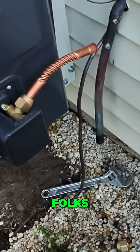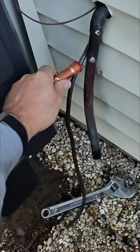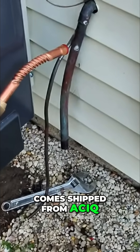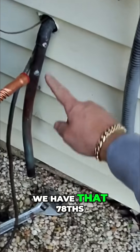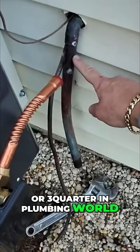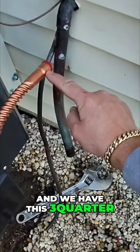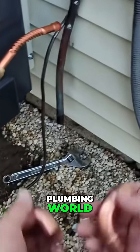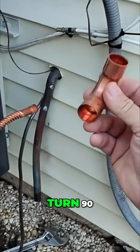Watch how I do this. We have this piece right here that comes shipped from ACIQ. We have that seven eighths — or three quarter in plumbing world — and we have this three quarter, or five eighths in the plumbing world. I got some fittings; I have a long turn 90 which will probably put me where I need to be.